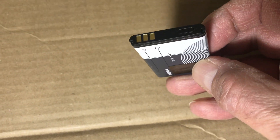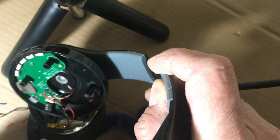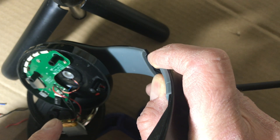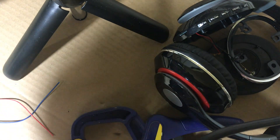As you can see, the battery indicates easily where to solder. I checked the fitment of the battery — it's going to fit perfectly in between the posts. The only thing I noticed is the wires from the old battery to the new battery are going to be too short, so I found some wire for it. I have two kinds but I'm going to use this one here as it's more flexible; the other one is a little stiffer.